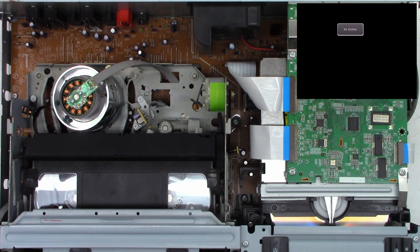And then we'll come over here to this one. These are all 330s. And I know my hand is definitely going to be in the way once again. And then that one is off the board. No circuit board damage whatsoever. Clean your pads. Fresh solder. Just wipe off the existing leads, just like that. And then same thing over here. Those are off the board.